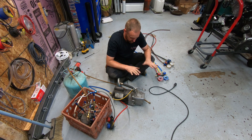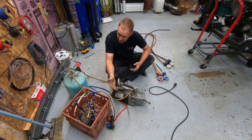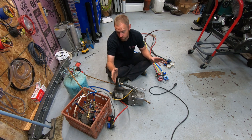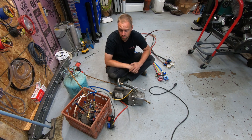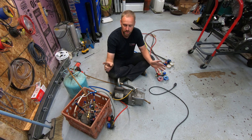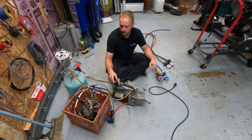Before I get too far in depth, let's start from the beginning. This is a homemade machine that I made out of an old window AC unit. I believe the era of that AC unit would have been R22 — it's not intended to pump 134A or 1234, however it is just a pump after all. It's got a filter, it can pump freon, that's all that matters to me. I don't care if I burn it out early — it didn't cost me anything. You can make your own if you'd like; it's basically just adapting some flare fittings. I used AN fittings in my particular scenario because it worked out best for safety, plus a bunch of valves to make the thing work.